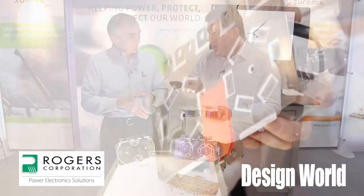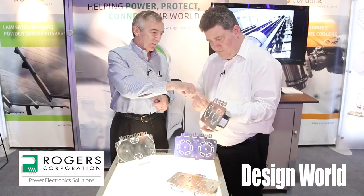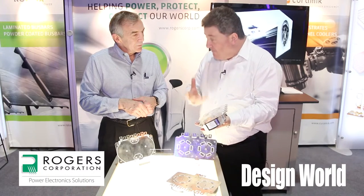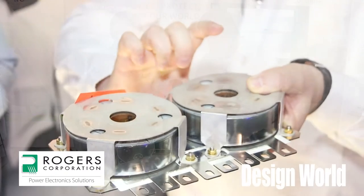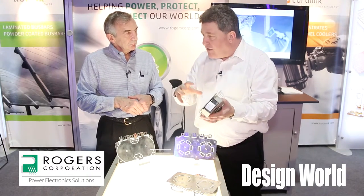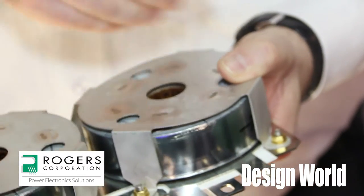Together we hope to professionalize this and take it to much higher volume production. I noticed these are spot welded at multiple sites on this side, and there's an interesting cap on the other side. The typical capacitor has only one connection port for plus and one for minus. Here we have multiple connection points for both plus and minus, which means you avoid hot spots — if you're running 400 amps through a terminal, here you have multiple terminals, so the heat you don't generate you don't have to remove. The other side is connected in a similar way. You could even put those ring capacitors on both sides of the bus bar, creating a very dense, compact inverter solution — something you can't do with any other capacitor because the mounting stud prevents it.